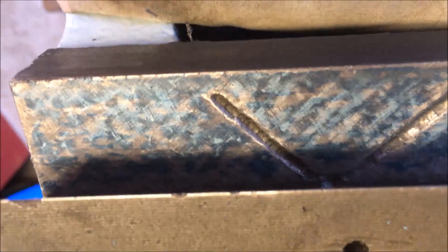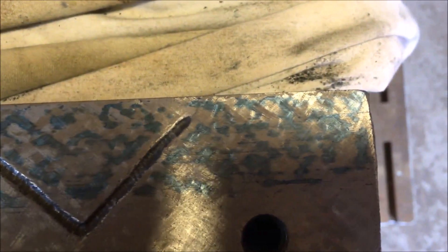That's the opposing scrape over the last one, just breaking up the blue. Then we do the same exercise on that side. Got a lovely print near side, and then on the far side nice and even — only three quarters of the depth — all that bit and all along the back edge have no contact, or possibly a couple of little bits.